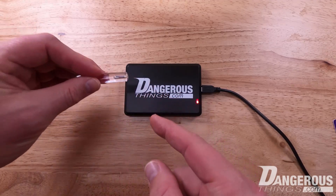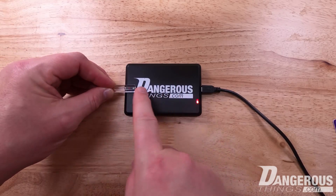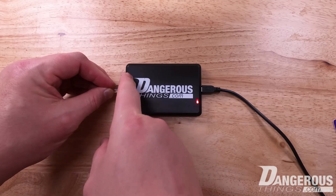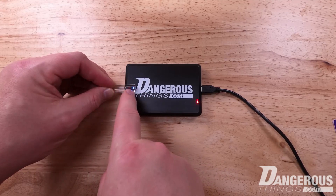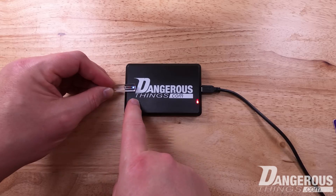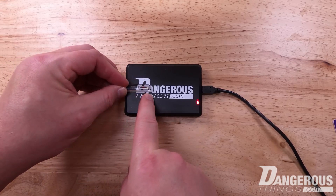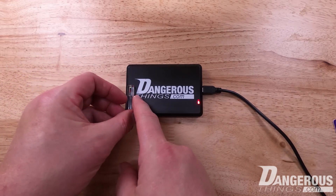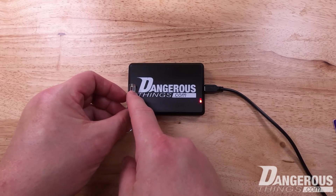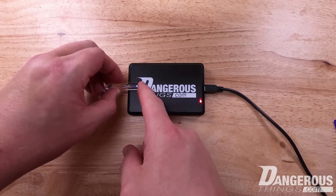When I present the device — there's no chip inside, so the reader doesn't beep, but it lights up. I know the antenna is here, so I'm going perpendicular to the antenna and I can see the LED light up. But if I go away from that antenna, the LED stops flashing. Likewise, if I present this not perpendicular but parallel to the antenna, the LED doesn't light — there's no flashing. It has to be perpendicular.